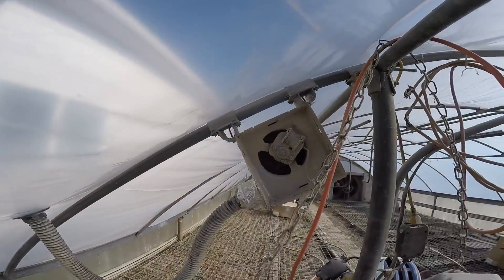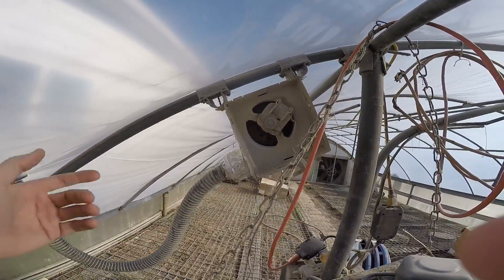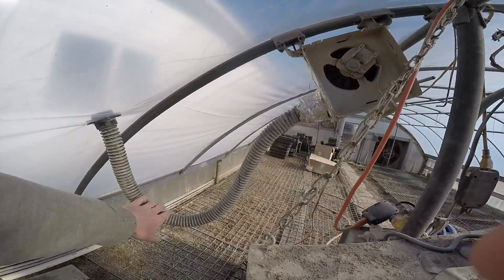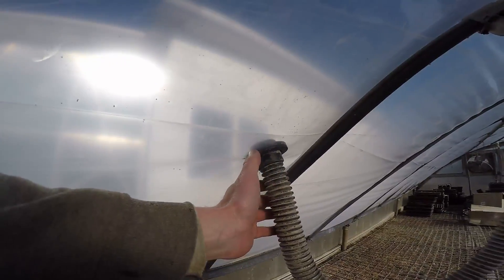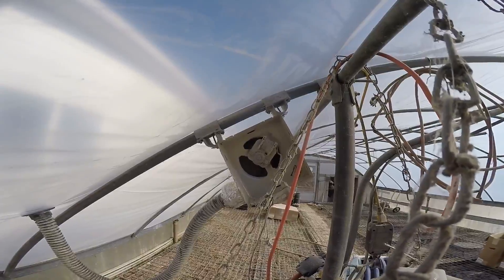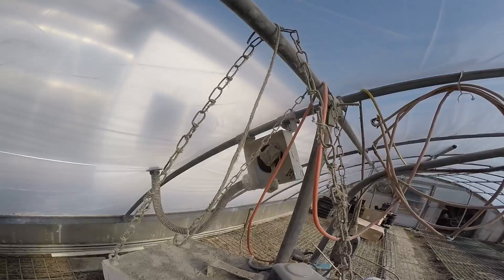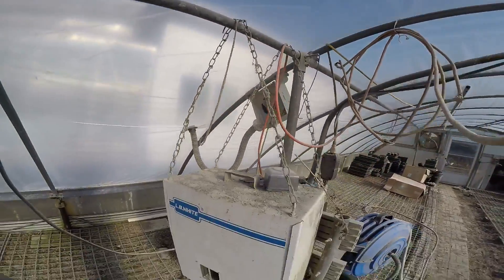To wrap up this whole party of a video — this is our little inflation device. It's nothing special, just a little squirrel cage fan, kind of like something you'd vent your bathroom with, and a little hose. This hose is probably the only specialized part — it's meant for inflating greenhouses. We cut a small hole in the plastic; there's a seal. We did that before we clamped the lower side in down here. That thing has been up there for many years running continuously. Cheap-ish little fans for venting your bathroom, and it works well enough to keep air between the two layers of plastic. Until more farming adventures, we'll see you later.